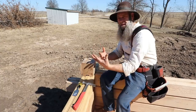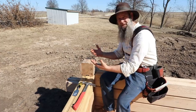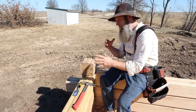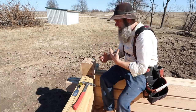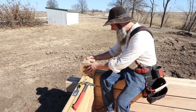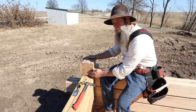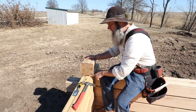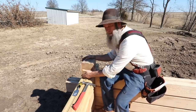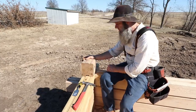Like at our house, the wood swells and shrinks. When the wood stove is on, it really dries out the wood. So you could definitely see the wood is moving. It's just moving with everything going on. And so you don't put anything in here, it's just a guide. But what we're doing is we're putting the glue on the end rails. And then when you set this on there, that creates a bond, so there's no air or anything that's gonna get through there. That's one of the reasons why you're putting the glue down.